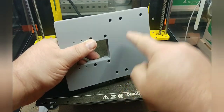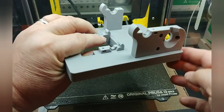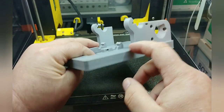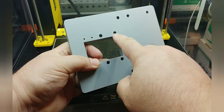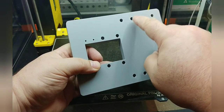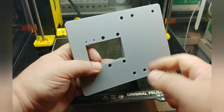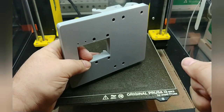Once you've got those four pieces installed, there should be no visible gap between the bottom of the pieces and the top of the base, and the square holes for the nuts should basically disappear right below the plastic of the base. To secure them, use M3x10 socket head cap screws in these five holes. For these legs use M3x10s, and for these four holes use M3x6. You can drive them in hand tight because the square nuts will secure it and won't be stripped.